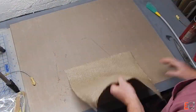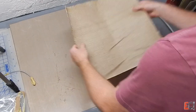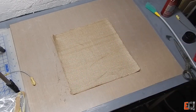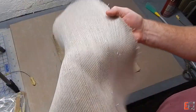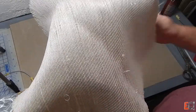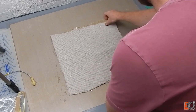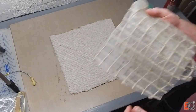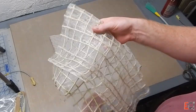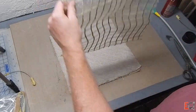Going to stick it down a little bit. This next ply is biaxial Amplitex Flax. And to create a somewhat balanced laminate — but not really — this is the BComp PowerRib going down in a 0/90 orientation.